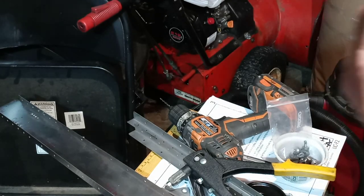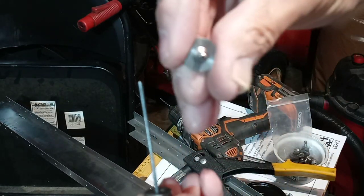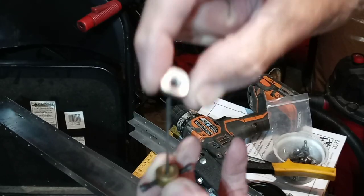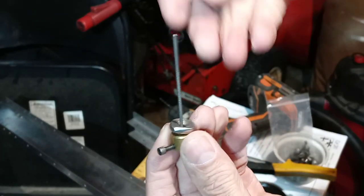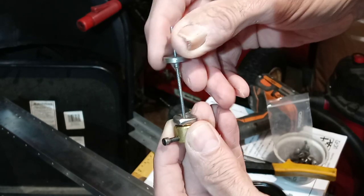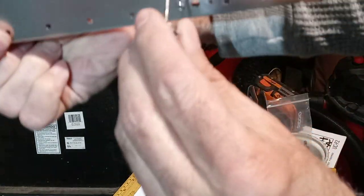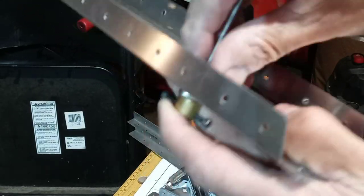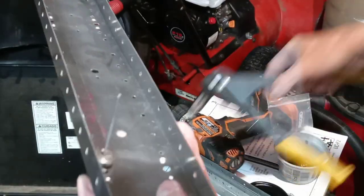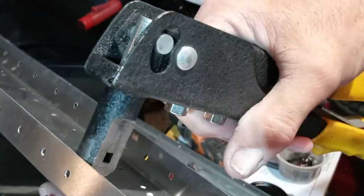Here's another kind of dimpler that I made on my lathe. And there's the receiving end. Anyways, I made that on my lathe. And then you put that in there — you put that in there. Put this on here. And then you just use a rivet gun — a hand rivet gun, I should say — and squeeze on it.